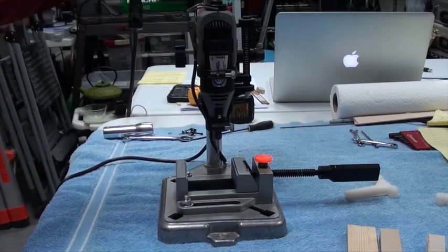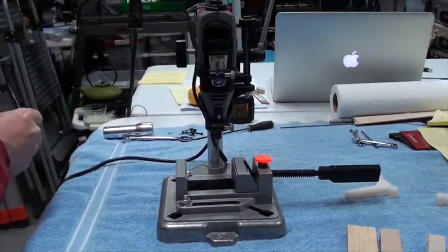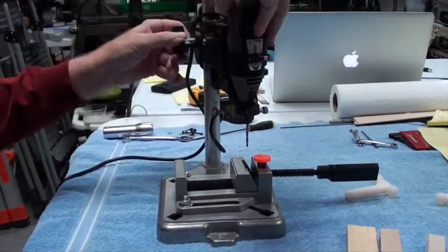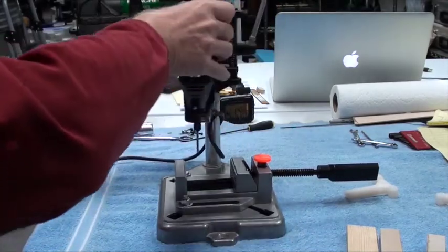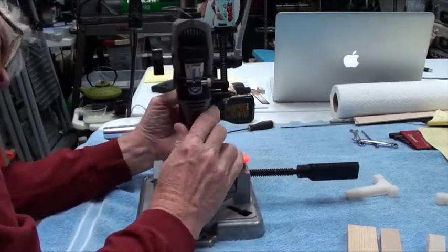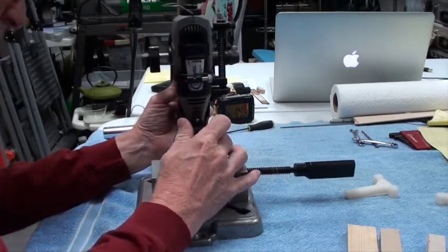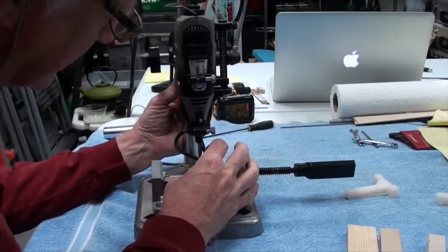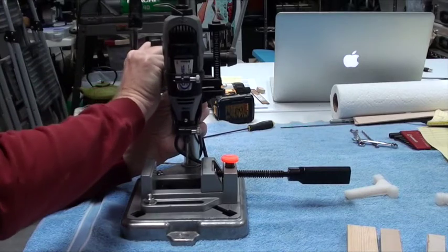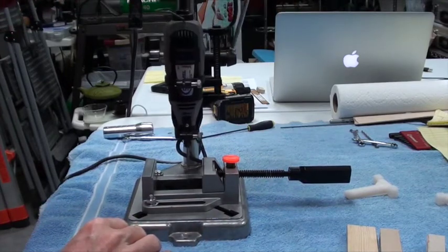It's nice because it's very flexible — you can raise this up and down by turning this knob here, and you can also swing it this way to get it right in the center of where you want it. So I'm going to try to center this, raise the bottom of the drill bit so it just clears the top of this clamp — I think it's called a machinist vise — and then tighten this down. That allows me to do a vertical drill, and that should work fine.